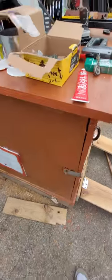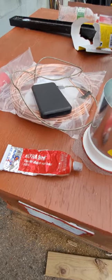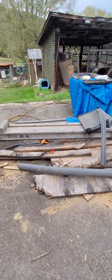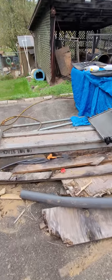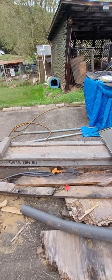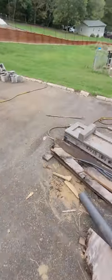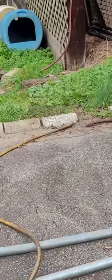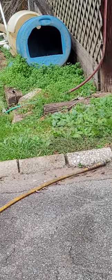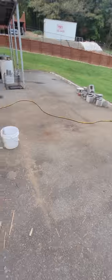I'm taking all precautions — this is my first rodeo with this. The only thing I have left to do is run the ground wire to the copper rod that I'll be installing. I got a 50-foot copper wire that I'm gonna ground out to the generator, and I'm gonna run it about five feet in front of that makeshift 55-gallon dog barrier house off to the side, just as a safety precaution.